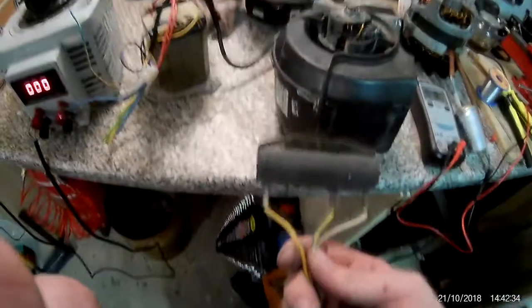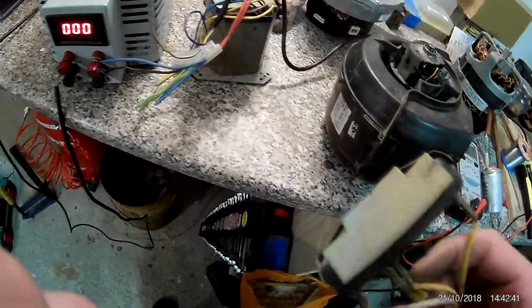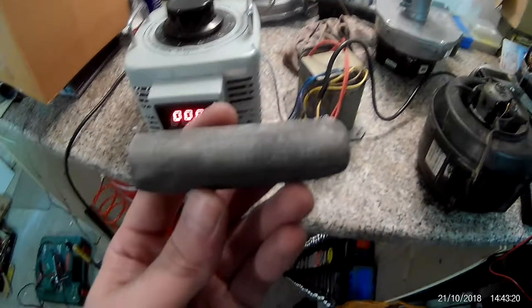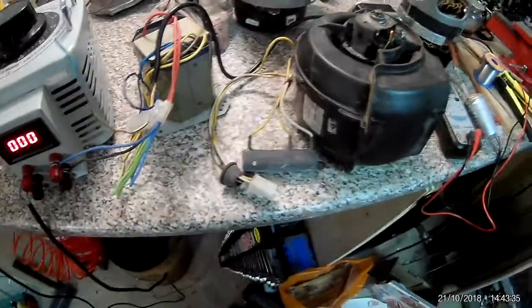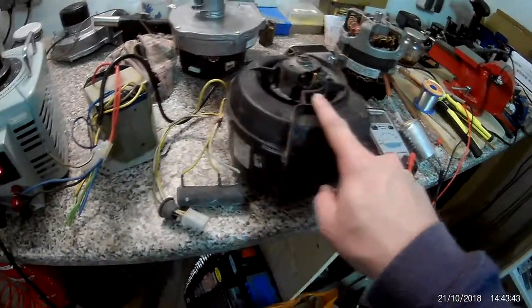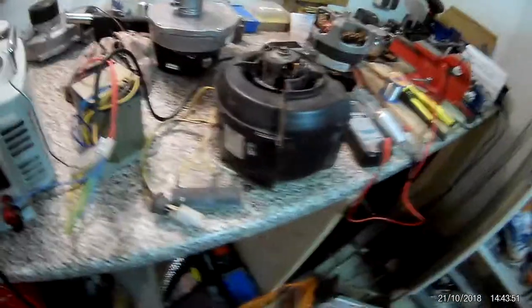Here's another piece of equipment — this is how you set different speeds for a motor back in the day when you didn't have semiconductors: a big resistor. It says 0.7 ohms and 1.4 ohms. This is how you'd regulate the blower speed for a car cabin — just put a resistor in series. I'm probably not going to use this because I'll just hook it up to a PWM controller, which is cheaper and doesn't waste power like a resistor does.